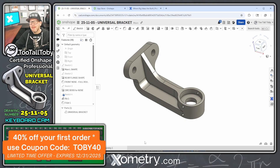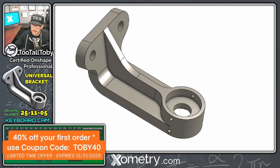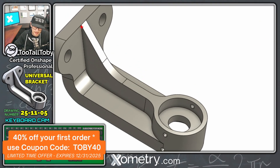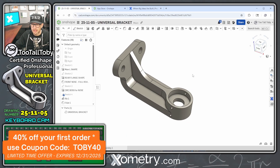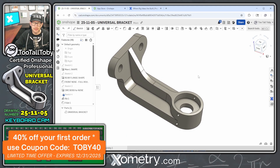When you're looking at a part like this, there may be certain features that are going to be a little problematic to CNC. One of those features is this edge here being sharp — that's going to be really difficult to machine and to maintain a sharp edge, especially in this region. What would make this easier and probably cheaper would be adding a nice radius here for a ball end mill or radius end mill to get around those corners. The Xometry app for OnShape will identify this and let you know it's a problem, even giving guidance on how to resolve it.